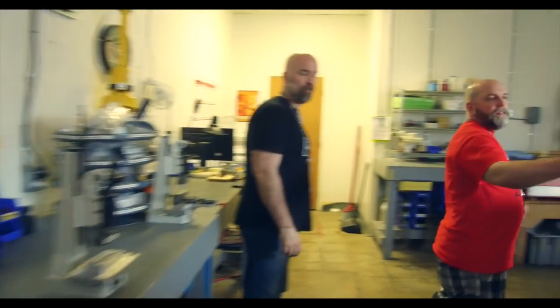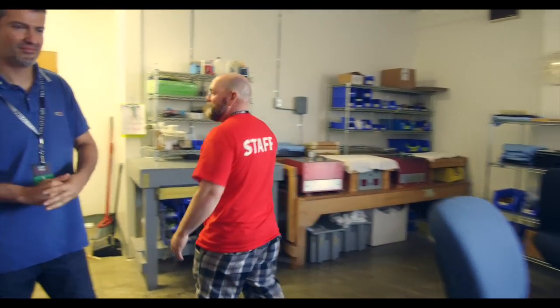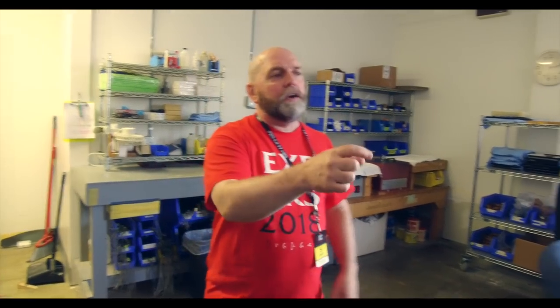The wire that's on those is very, very fine, almost hair-like. Now, I can't relate to that because I don't have hair, but if I did, it would be like that. So they wind the pickups a certain amount. What you see there are lead wires. There's a lead wire on the inside and the outside of each individual bobbin. And then someone has to tape those wires together. They solder the wire to the leads, and then they wrap them with tape.